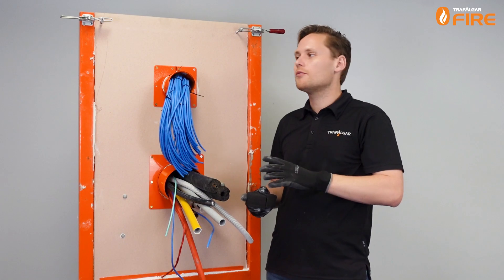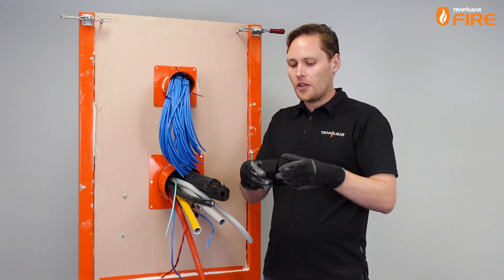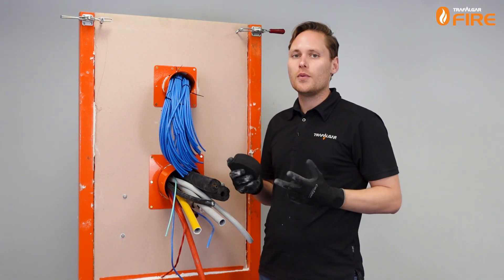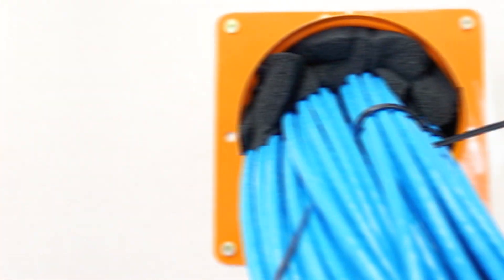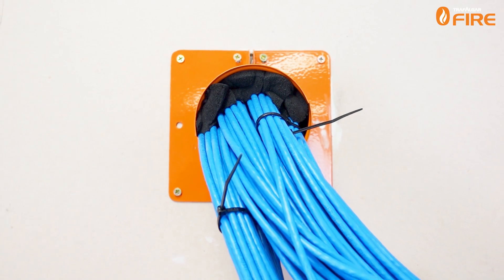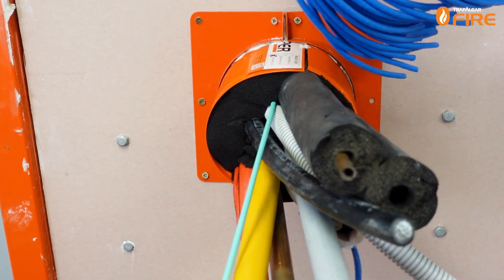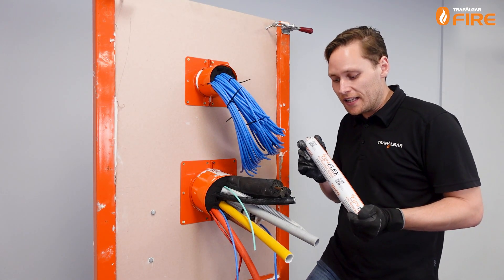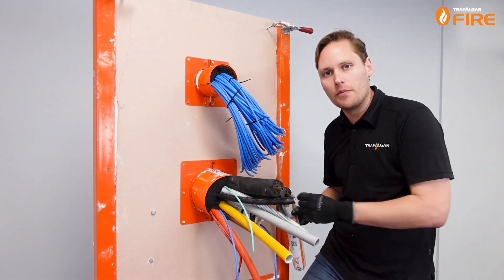With walls the flanges go on both sides with the Superstopper centred in the middle. With a floor situation we only put the flanges on the top side, and once that's done it's time to fit the foam. The foam comes conveniently in these little pads which we can now cut to fit around the services. These foam plugs give us the acoustic, smoke and movement performance of the Superstopper, so make sure they're nice and snug and tight — once installed on both sides of the wall you shouldn't be able to see any daylight going through. If there are gaps in the foam, don't stress — you can seal it up with the Fireflex acrylic sealant or the Firepex black intumescent sealant. When you've got mixed service bundles you can group them together, but if there are gaps in the middle just jam a bit of foam or sealant in there.